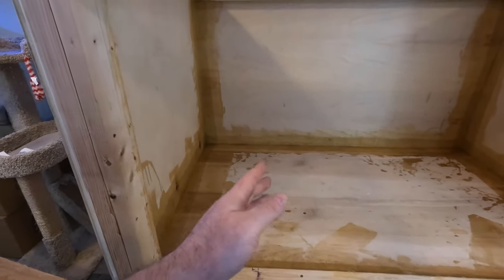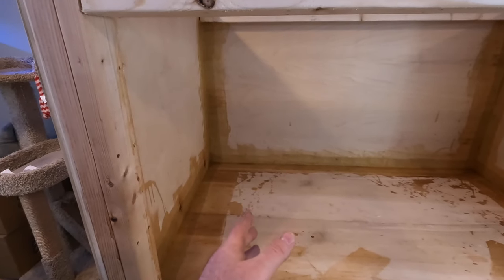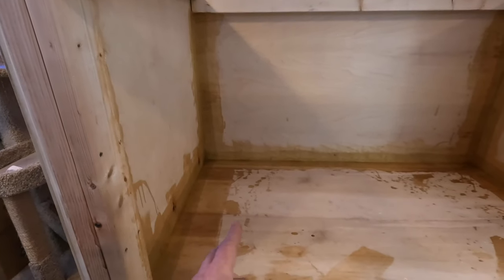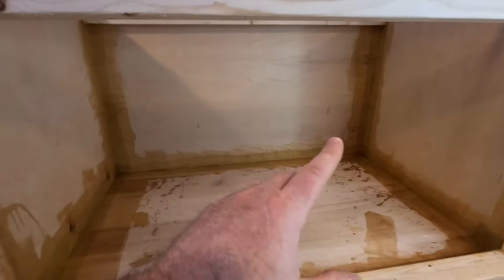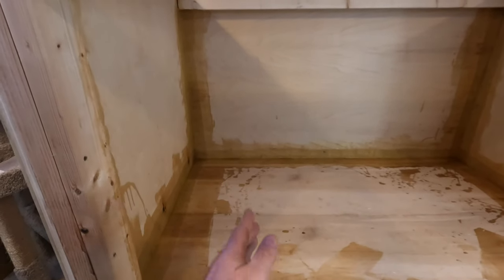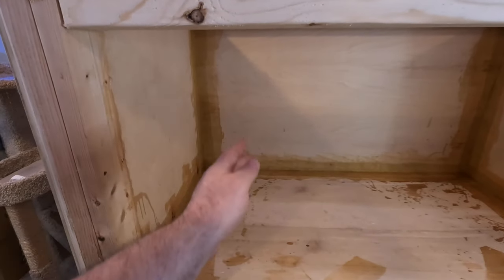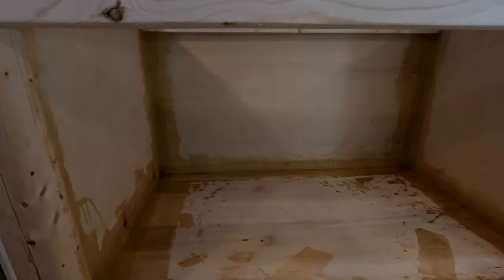Now, there is going to be water on both sides. There's not going to be a ton of pressure on it, but we still don't want it to move whatsoever, because it is a structure that the pond shield is going to be painted to. So just like any other part of the structure, you can't have any flex or movement in it, because that will undermine the waterproofing. So once we install the baffle, you'll see basically what I'm talking about, and we will get it all in place and make sure it is super rigid.